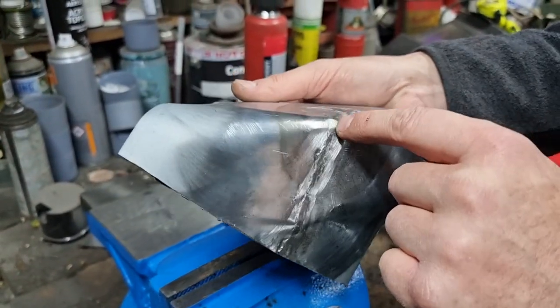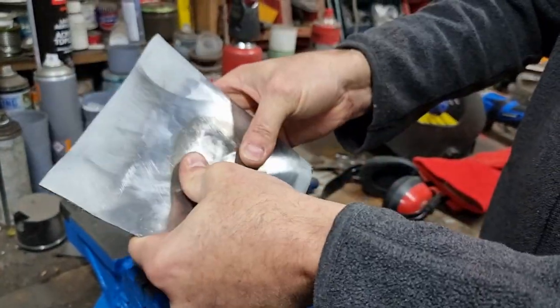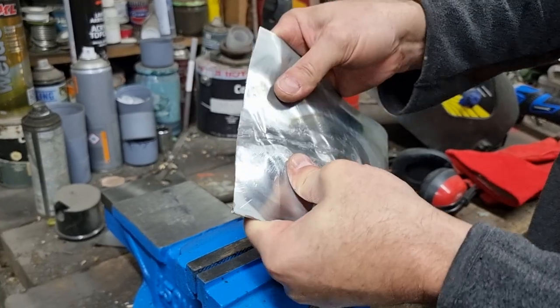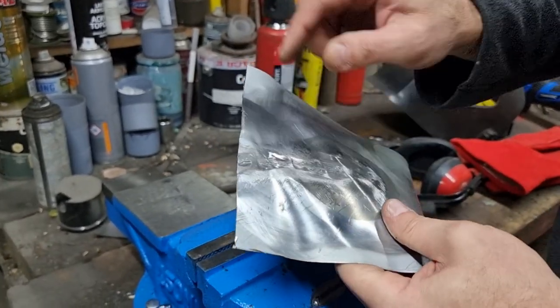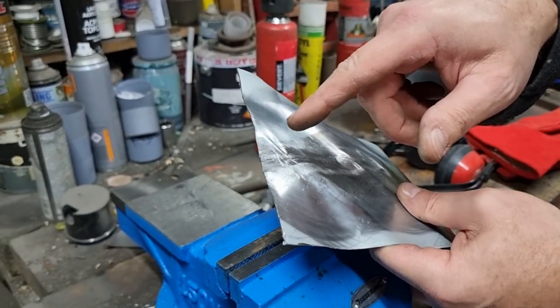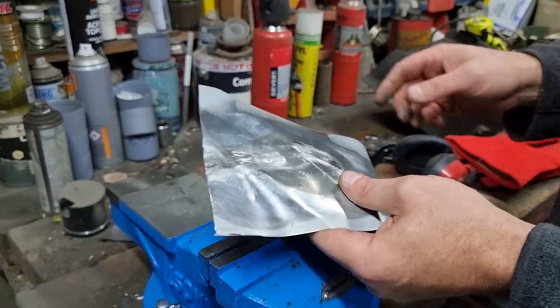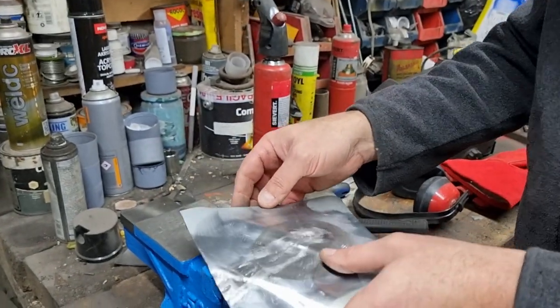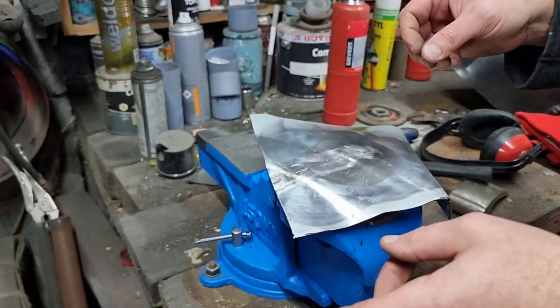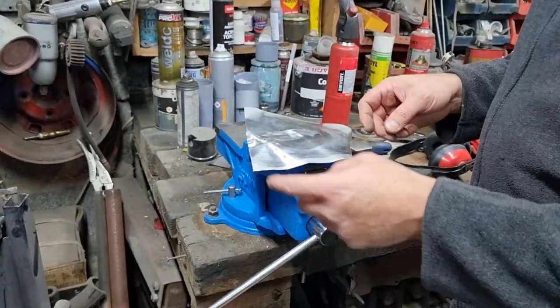So it has softened it, but I don't think it's a process which is necessary, because I think that weld, even though it's still harder, is still soft enough to planish. And I think that's mostly down in the past. You see me cooling welds off with the air gun. Air compressor. Yes. Yep. That's the word. Air gun.